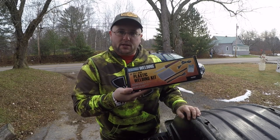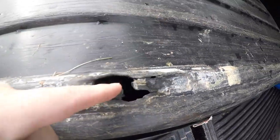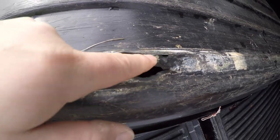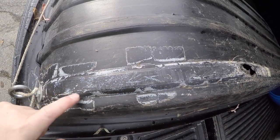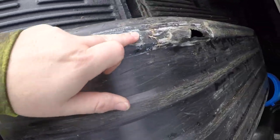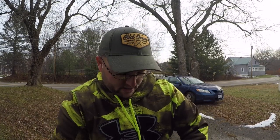This is the medium-size sled and I use it the most, so instead of going out buying a new one I figured I'd put the plastic welder to use. It's pretty beat up — this plastic is really flimsy and in rough shape. You can see duct tape that's probably 10 years worth. I tried duct tape and it only got maybe half a season. I tried fiberglass and that held maybe a year or so — did it two seasons in a row then pretty much abandoned it. Just didn't last. I think the plastic welder is gonna work.